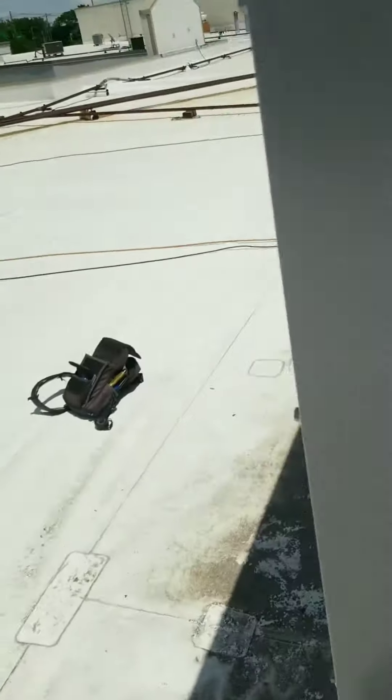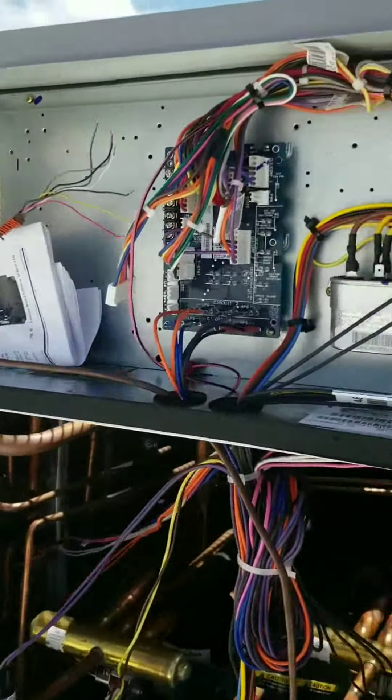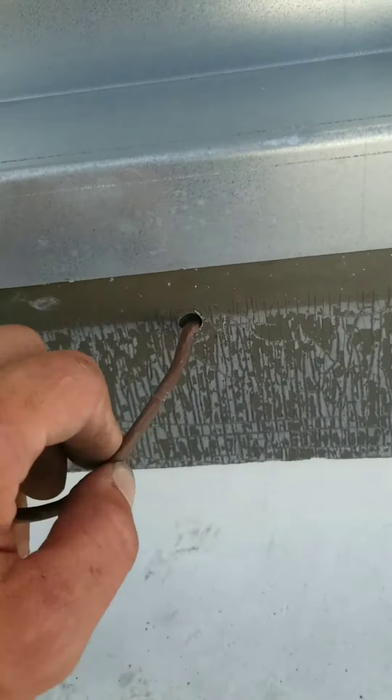Checked my normal spots — I had a low voltage short today. My breaker was tripped and the thermostat was disconnected. Reset the breaker, cycled the unit from here, and no problems. So then you trace the wire out and this is what they did — that's a short waiting to happen.